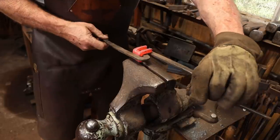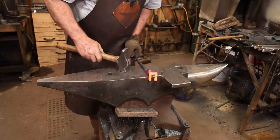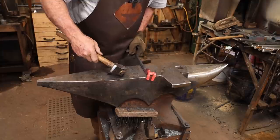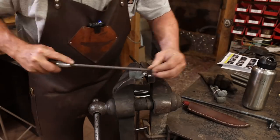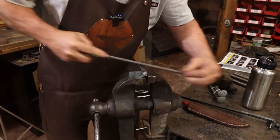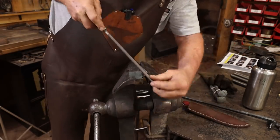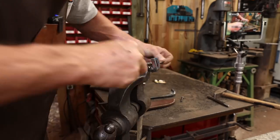In both cases, when you do this twist, you want to go counterclockwise. The next thing to do is drill or punch some holes. The raised square corners from the twist will probably be in the way and affect the function of the tongs, so make sure you clean all that up with a file or a grinder before you assemble. This is also a good time to deal with any little cold shuts or anything else that looks like it might become a stress point.